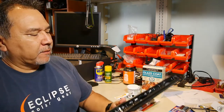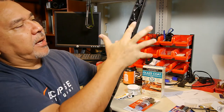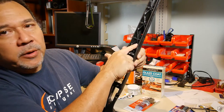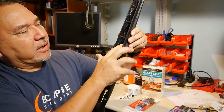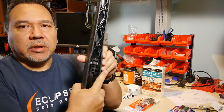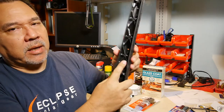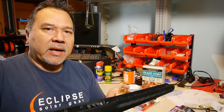You mix it up in a cup and you can pour it into these cavities. If you're going to do that, you can see the little ribs going across in that little truss pattern. Between the cavities, I got in here and roughed it up with a Dremel and drilled a hole through the ribs so that when you're pouring it in, it kind of seeps through the hole and lessens the chance that it's going to work its way loose and fall out — the little hole acts like a little retainer. Everywhere else I poured this stuff in, left it level, and let it dry. When this stuff is drying, it puts out a lot of heat. It's pretty cool stuff.